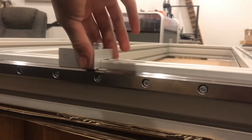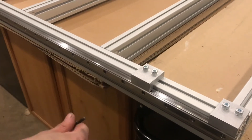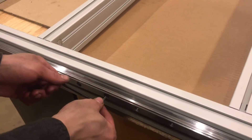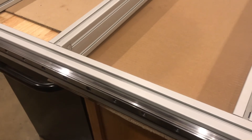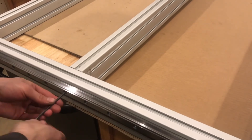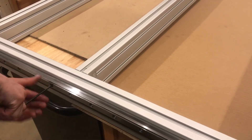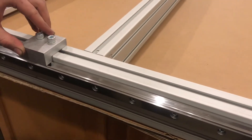The extrusion has its own tolerance and straightness behavior, but now everything is straight and set in place, so I can tighten all the bolts. These bolts don't need to be overly torqued — you've got so many of them, and you've just gotten everything straight. There's no sense introducing any unbalanced bowing from over-tightened bolts. Just snug them up — every one of those bolts contributes to the strength, so this thing's not going anywhere.